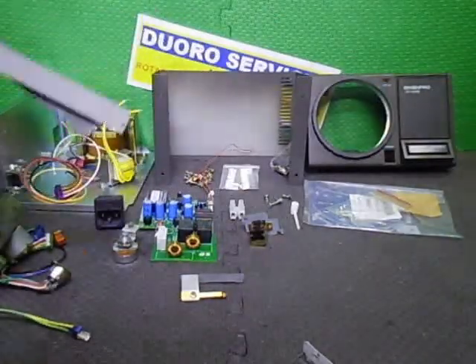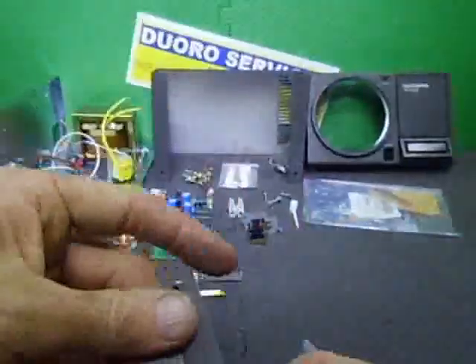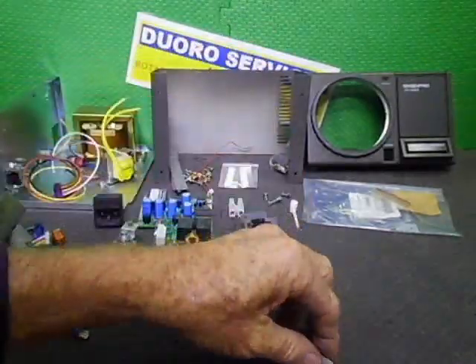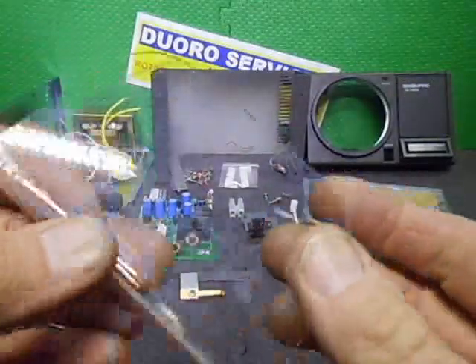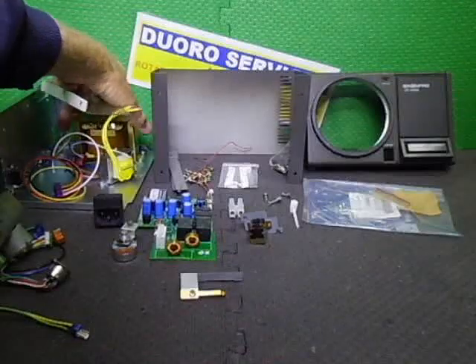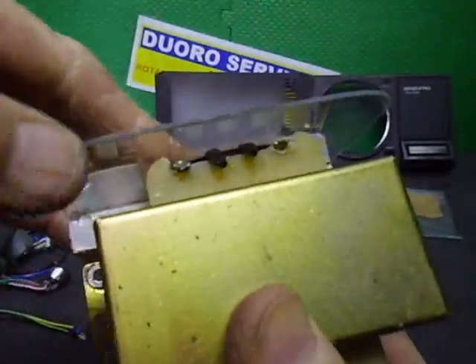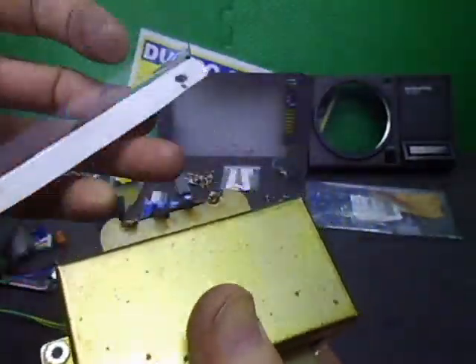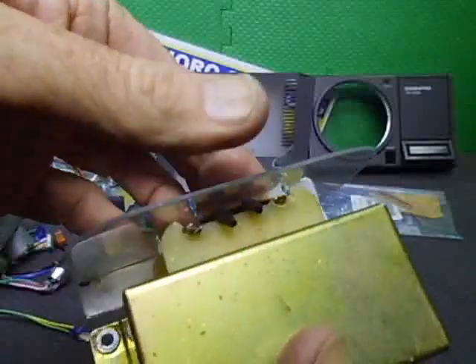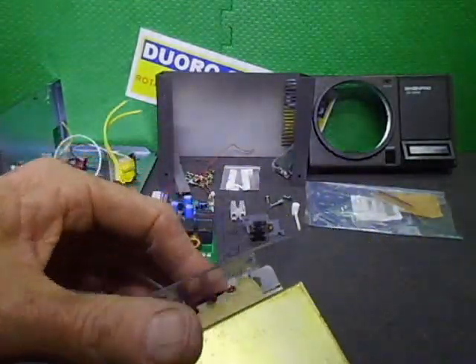Since the board sits across the back, I had to take a little piece out to let it pass. I've also made up a small right-angle Lexan cover that goes down the side. The AC side faces out, and this cover sits hard against the chassis — it keeps hands away from the transformer and prevents the top housing from pressing against components if pushed.